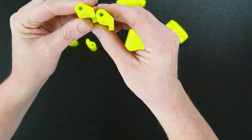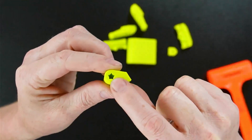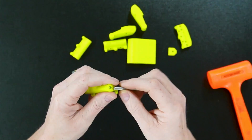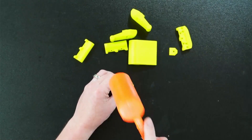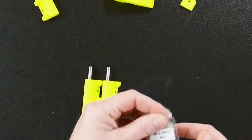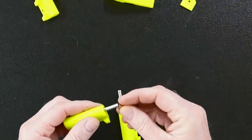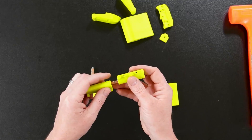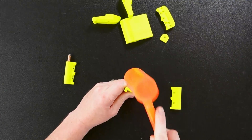We've got these two parts - they're called the solid hinges. You can tell the difference because one has a star and one has just a circle. Take each one with a star and knock the pin in until it's got about 20mm sticking up. It may be easier if you use the rounded pin in first - just knock it in there. From here we grab four bushings, slide two each onto these, then take the other hinges and tap them in just like this.